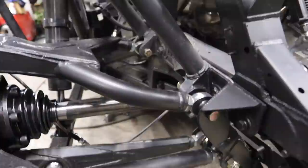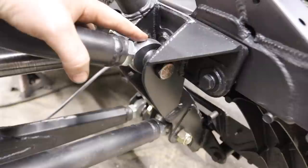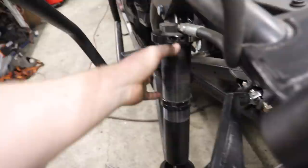So they're Ford splined. This piece right here was over here and it hit the axle really soon. Once we move that, we won't hit the axle and we can go all the way up and all the way down. Now the shock is the limiting factor in the travel, which is how the vehicle was designed. We have like 17 inches of travel in the back. I'd never ordered axle shafts before and we waited until the very last day to test these out — I'm very pleased to say that they fit and we're getting all the travel out of them. That is fantastic.